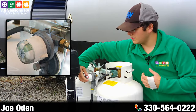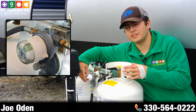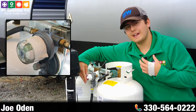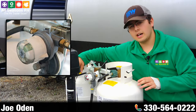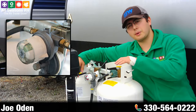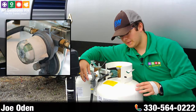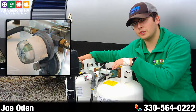Most regulators have a little indication arrow — there's a little point or some arrow drawn on the regulator itself that's going to let you know what tank it's drawing off of initially, and then there's some sort of center knob that you'll twist back and forth. Basically what that does is it creates a primary tank and a reserve tank. So if I have the knob facing to my left here, that's going to make this the primary tank and the tank on my right the reserve tank.